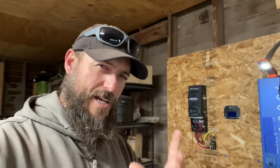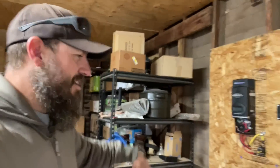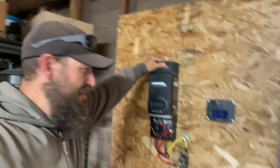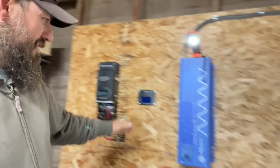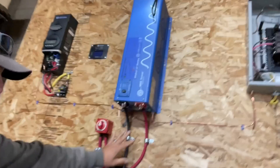Alright friends, it's a couple days down the road — had to run and get some more parts, it's cooled off outside. Heading back to our undisclosed location today to get some more work done. We're going to get the battery bank hooked up today for sure, and hook up the inverter and power a load, make sure all that stuff works before we tie it into our main panel system. We're back in the shop at the homestead. After a little time lapse, I got a few more things wired. Solar charge controller is all mounted up, got all our wiring hooked up in here. Not hooked up directly to the batteries yet. Same thing with our power inverter — she's all mounted, we've got our main cables going to it and our shutoff switch. And our heavy gauge cable is coming off the top of the inverter, all wired up, coming down to our main panel.